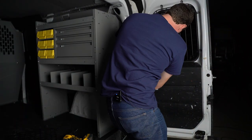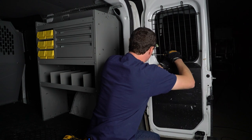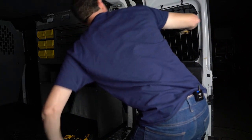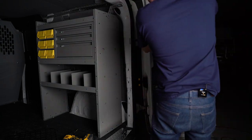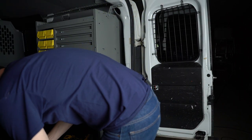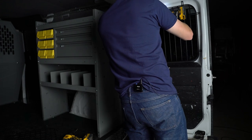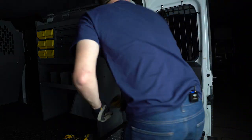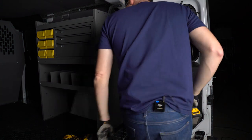Obviously there's two ways to put a screw in — you can just take your Phillips head screwdriver and screw it in, which I'll do on these first two. Here's a sheet metal screw and a lock washer to get these started. And then obviously the alternative is to use a power tool. You don't want to get these too tight — you don't even want them to pull. You want them to be super loose because you want to get alignment of all of these holes first, else it's going to tug it in one direction and you're going to lose alignment on one hole. So we're just going through getting them very loose.